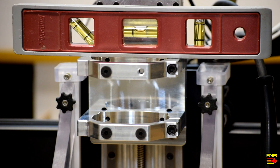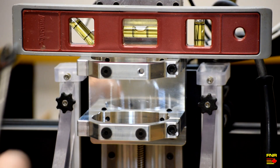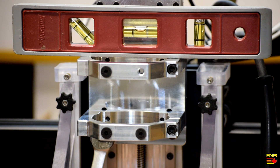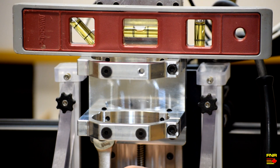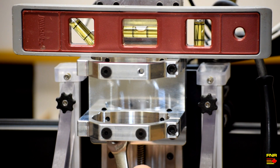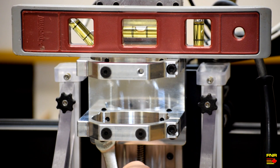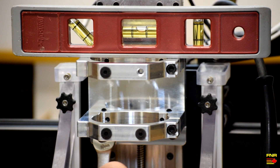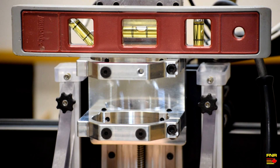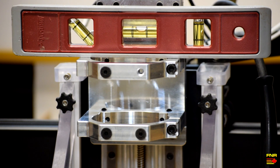That's brilliant, and I love the fact that it reuses a standard X-Carve part. The mount is now attached to the Z-slide. I've got a spirit level sitting across the top of the mount clamps to demonstrate how the tram mount works. I'm going to take the wrench and put it on the cam. As I turn the cam bolt back and forth, you can see the level changing — like so, back and forth. That means we'll be able to dial the tram in pretty much exactly.